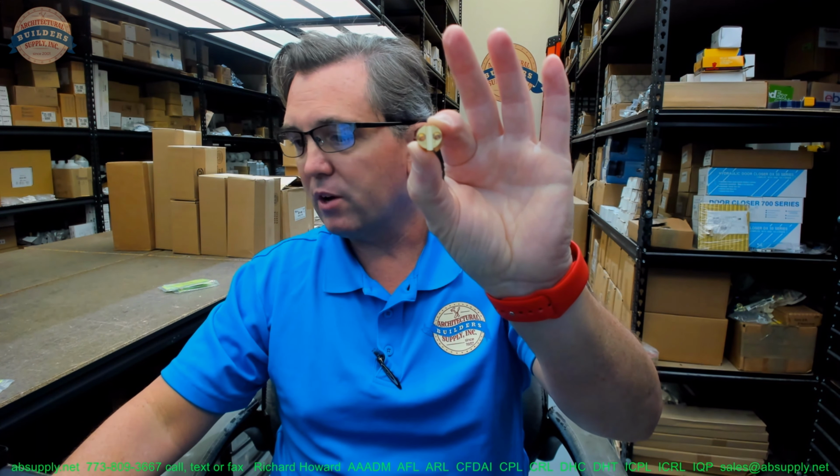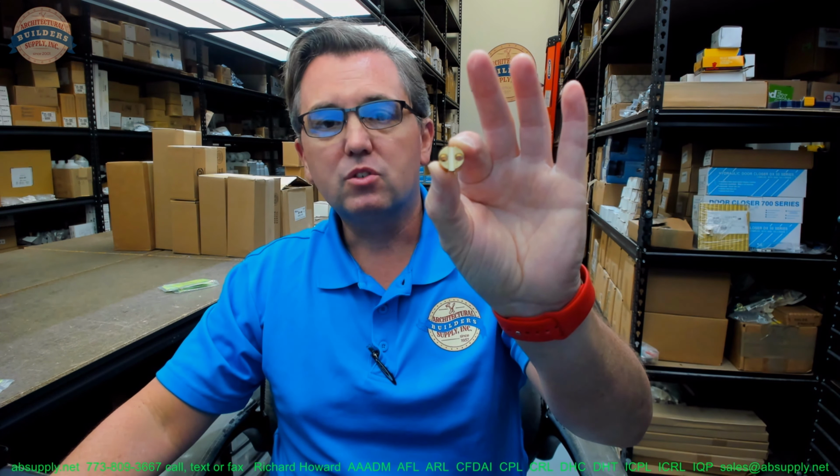For me, I use Kaba Ilco cylinders generally when I'm building a custom length. So where you would be looking at this is the following. You have a requirement for 2 1/4 inch length mortise cylinders, and I need them now, basically. So what we end up doing is pulling off of the shelf a stock mortise cylinder, let's say 1 1/4 inch, 1 1/8, the most common sizes that are going to be kept in stock. And we can use the Major system of extending that cylinder, the drive cam is part of it, to give you that 2 1/4. That's just an example.